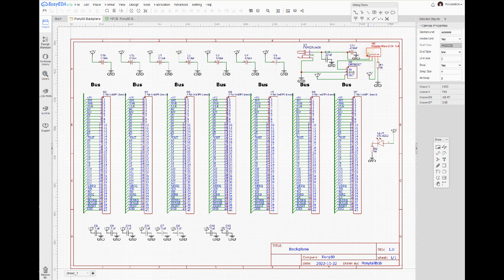With the LM317's variable voltage pin, we can turn the voltage totally off without putting 1 or 2 amps through a switch. It's kind of cool — like Marty McFly walking in and hitting the big circuit breaker to turn on the guitar amp. But in all practicality, we really want to limit the current going through that switch, so I'll do a video on that in the future.